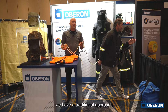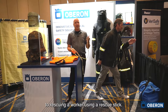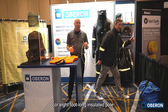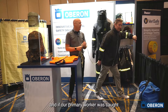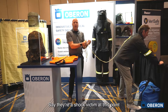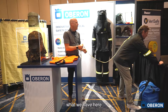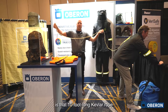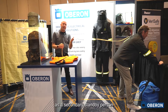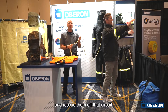In this industry, we have a traditional approach to rescuing a worker using a rescue stick. Rescue sticks are typically a six-foot or eight-foot long insulated pole with an 18-inch hook on the end. If our primary worker were caught as part of a circuit — let's say they're a shock victim and they've passed that point of can't let go — we have this 10-foot long Kevlar rope, a non-conductive rope, and a secondary standby person can pull that worker and rescue them off that circuit.